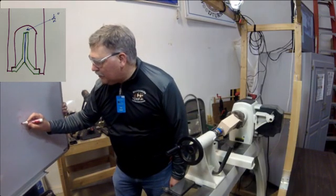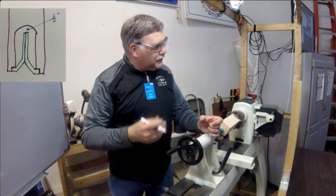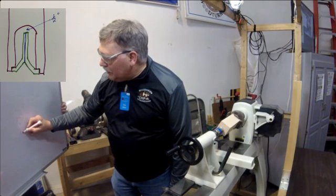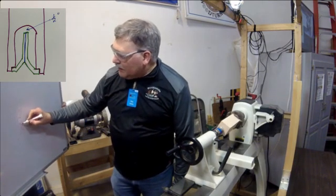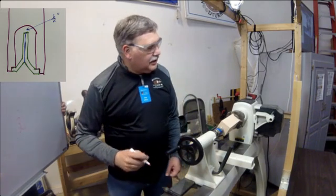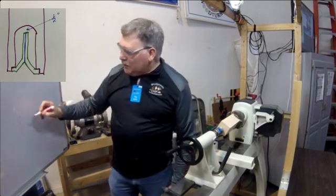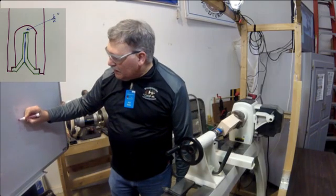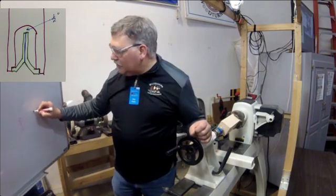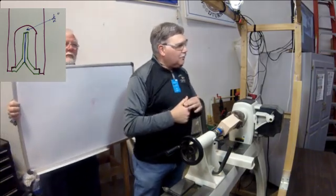It's going to be a little natural funnel, so when you go to fill the salt, you just pour it in the funnel, turn it upside down, and the salt fills in. When you shake it, there'll be a hole through here, obviously, as you saw. The little granules will bounce off this dome towards that hole, and they'll come out for you. Does that make sense? The only critical measurement is the distance between this dome and that little hole, and that should be 1/2 inch. Everything else is free form, whatever shape you want to come up with.